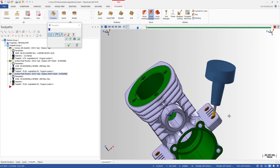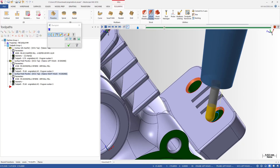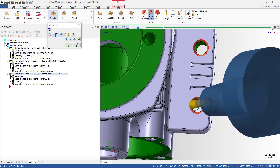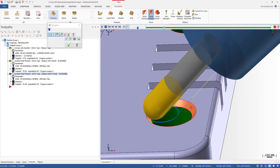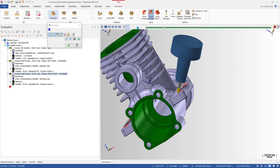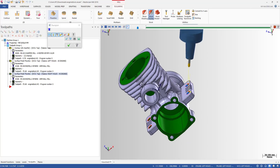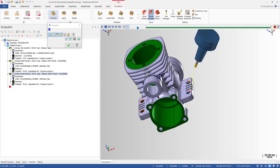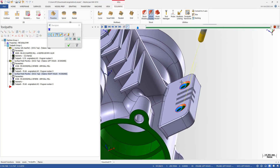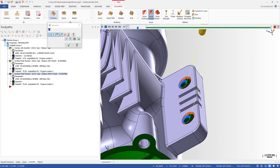Take a look from the left — even with a 45-degree tilt, this surface can be machined with no problem. If the chamfer is 45 degrees, you can tilt the tool plane a maximum of 45 degrees and machine it with no problem. You don't need a fully simultaneous five-axis toolpath — just tilt the part to an angle and machine it with a normal 3D toolpath. Very simple and very effective. Using a ball mill to create a chamfer — no problem.